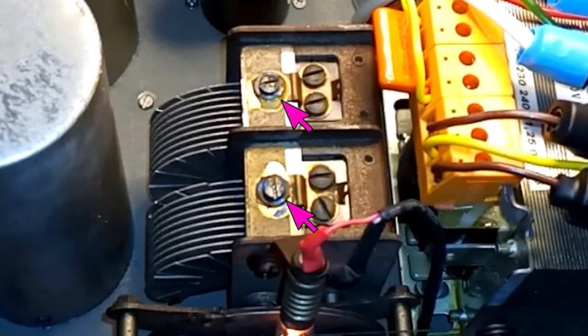To avoid damaging the variable capacitor, only a simple alignment is done with the trimmer capacitors, tuning to a frequency in the medium wave band and trying to get the maximum output signal. Consequently, the long wave band could not be aligned.